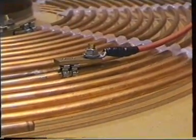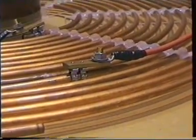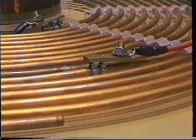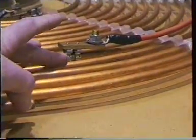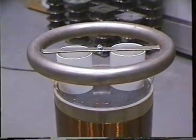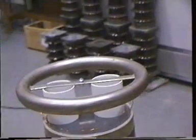These are the little clips I made — just simple clips from Mitre 10 — made it convenient to clip on to the primary winding. One there, one up there. Arms tapped out at about 11 turns. If we lower the resonant frequency of the secondary, these can be tapped further out, can be tapped out to here as the resonant frequency drops. The toroid is just a standard toroid that they use around here to stop sparks breaking out on high voltage things. A little bit of PVC drain pipe to hold it up. That's about it really.